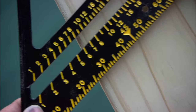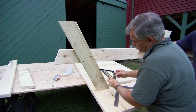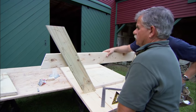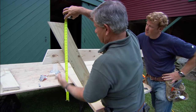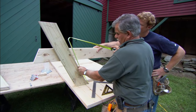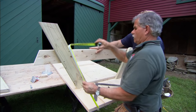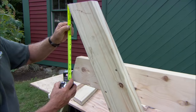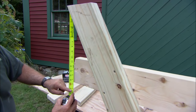The leg angle right here is actually cut at 28 degrees — you can see it right there. Now it's a parallel cut so we have to cut the other end at 28 degrees as well. Now what about the tabletop height? Well, the tabletop height I like 30 inches. So 30 inches would be straight down to the top of the table, but because the leg is set on a diagonal, that means the leg has to be cut at 32 and a quarter inches. Now what about the seating bench? A good height for that is 16 to 17 inches off the floor. So if I measure down right here I have 15 and a half plus the thickness of the seat — it's gonna give me 17 inches.